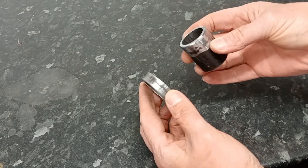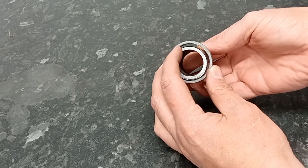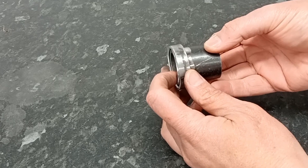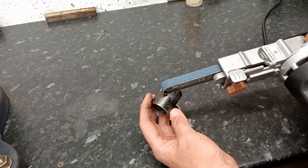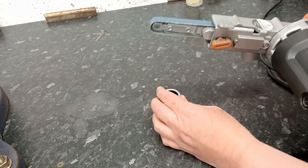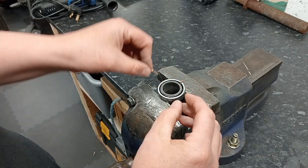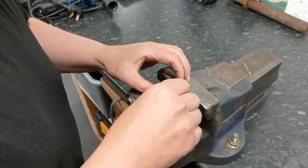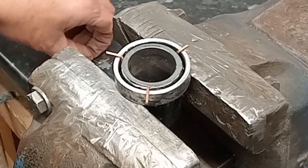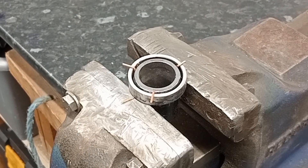Right, chop some tube up. As you can see there's a big gap in there but I'm going to fill that with weld — a bit rough, but I don't want to spend ages machining out a solid piece. I've just cleaned it up with the electric file, using welding wire which I've flattened just to get about the right distance. That keeps it nice and central. Voila.